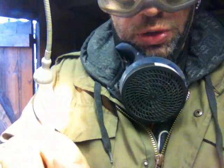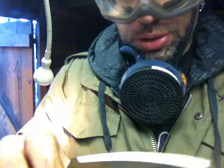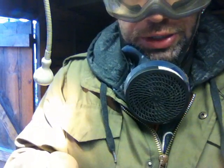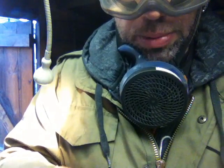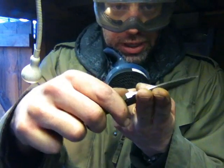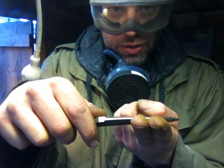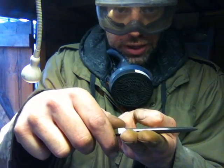And now what I'm going to do for the first few passes is basically, I'll put a link in the description box to my Break the 90s vid, because that explains that process a lot better than what I did just then. And you can check that out. But basically I'm leading in, say the plunge is here, I'm leading in like that, and then going across like that. So I'm cutting in with the edge of the belt, and then I'm going across like that to flatten it all out. And I'm going to do the same thing here when I start doing the actual grind.